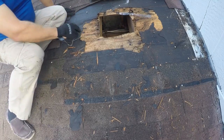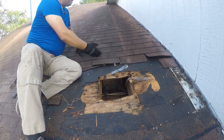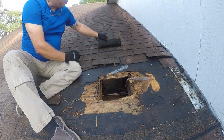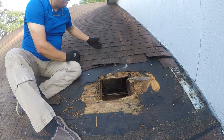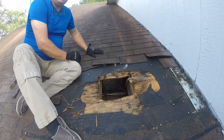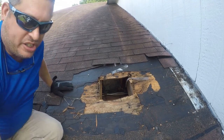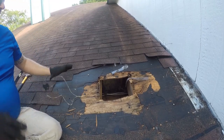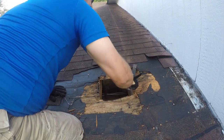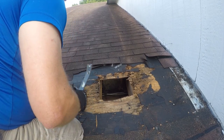One thing I want to point out: if you've got an older roof you can do a repairability test. Make sure the shingles are not broken, then just take one and bend it up to about a 45-degree angle and let it down. If it doesn't crack or break, you're good — your roof is repairable. That's how we do it in the insurance industry and that's what a good reputable roofer should do. If you've got a lot of repairs it may make more sense to replace the roof, but you might just need to squeak a few more years out of it before putting a new roof on.